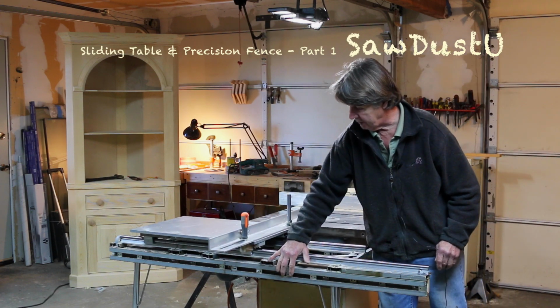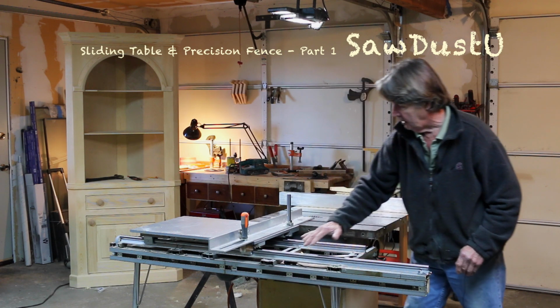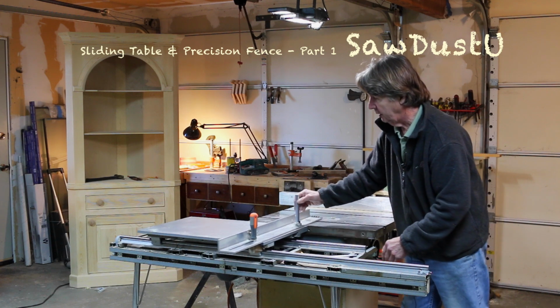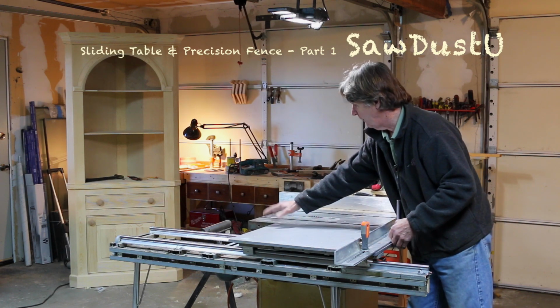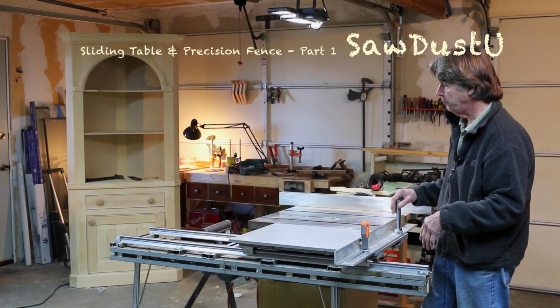What you have here is a platform. It can be open like this, or on my other saw, actually I had one with a plywood cabinet under here. And then you attach your rails on top of that, and then you build a sled to accommodate your needs. Now, in my case here, I went 18 inches by 27, which happens to be the depth of my table saw, but you can configure it any way you want.